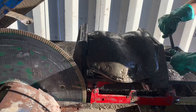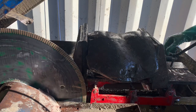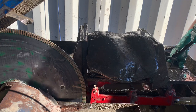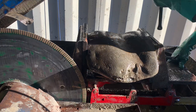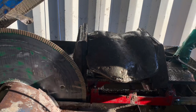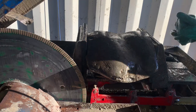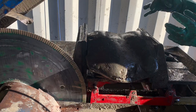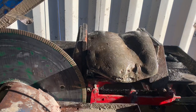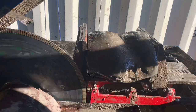All right, so one more note on not breaking your vise grip. Listen to the sound it makes. When it starts to scream, that's when it's time to stop tightening. So that's more like a groan, but you'll hear it go a little higher pitch and a little louder. You go one more, there we go. That's the sound I hear when it's really getting tight and really hard to tighten. So I stop there.